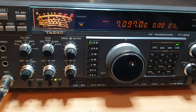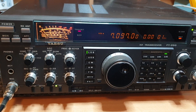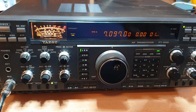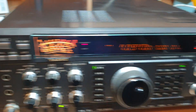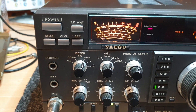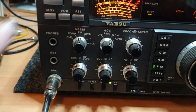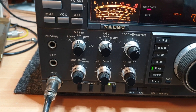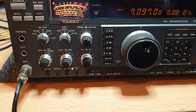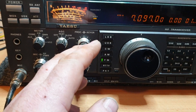So let's put an antenna on this tuner. I'm interested to see if this tuner can tune a 10 meter antenna on this band. VK3 Charlie Mike about to do a tune test. I've done the nice thing and mentioned my call sign just in case someone came up — I could be talking to someone you can't hear. Let's hit tune. Look at that — one to one SWR, and that's on a 10 meter antenna, with full power out. It's actually showing a hundred watts out there. Heaps of power — the tuner on these is exceptional.